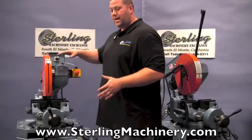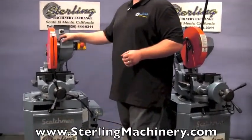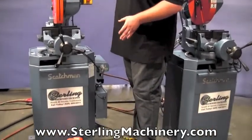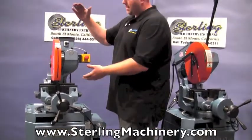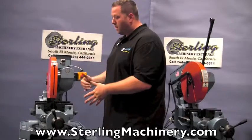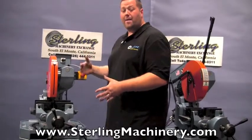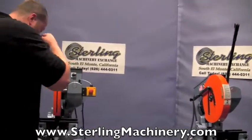The PK and the PD go together very well. The PD is going to be the power down feed, which means this saw will automatically — once you push this nice little foot pedal down here — automatically send the saw going down, the vise will clamp, part will cut, head will come back up, and the vise will reopen again. This will keep hands and everything out of the way.